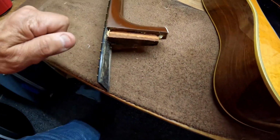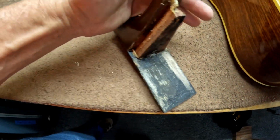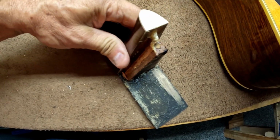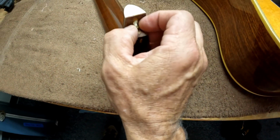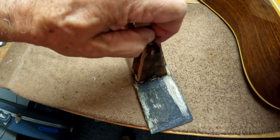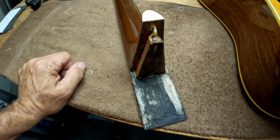I don't think I like the heat sticks that much. I'm going to be looking for another pressure cooker. Also, the other thing I noticed here, the heel is not really hot, but it's warm. The heat stick was definitely heating up this whole joint here, but it just didn't do a good job of getting that Titebond. That's on there tight. But if this was steamy, I'd be able to just peel that off. Now I've got this hard glue mess here I have to clean up.